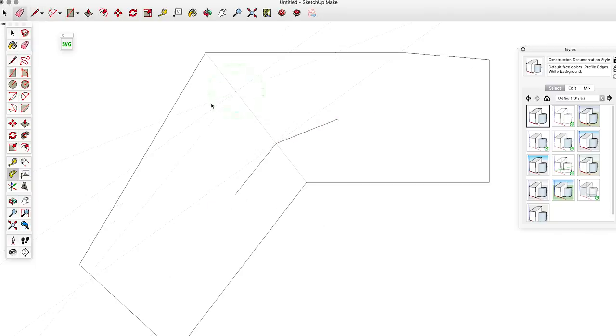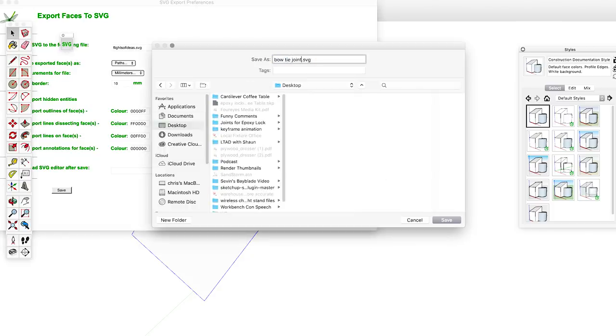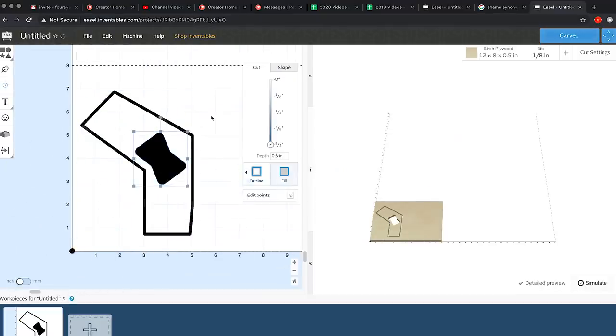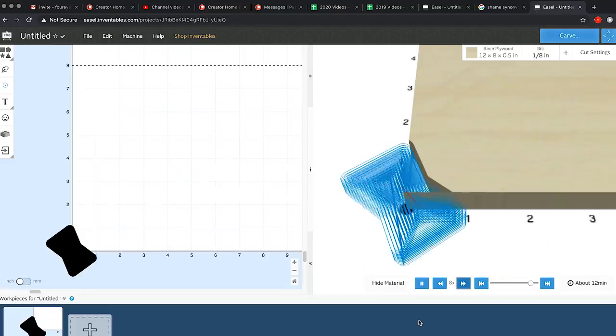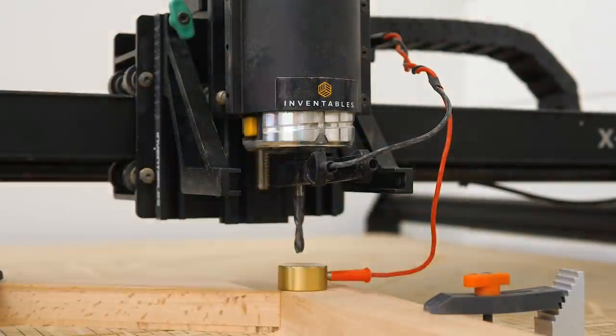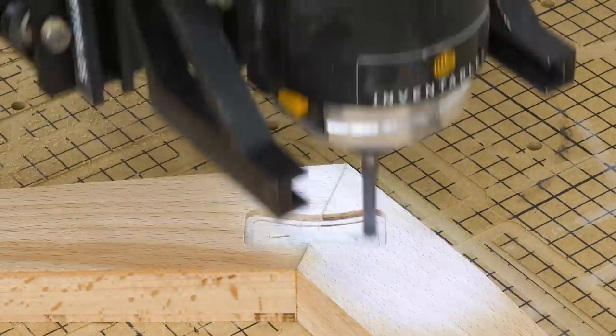You could cut this manually or with a CNC, but for my purposes I'm going to use my X-Carve. Here you've been seeing me model my first idea, which is basically like a butterfly or bowtie. Once I was happy with the shape, I exported it from SketchUp as an SVG file that I could import into Easel to cut on my X-Carve. In Easel I had to eyeball it so that the center of the cut was positioned right at the 0-0 origin within the software. Then in real life, over on the X-Carve, I positioned my bit at the center of the joint and hit carve and let it do its thing. For the most part this went really smoothly — I only had one mess-up on one joint, definitely user error where I kind of positioned things badly as a starting point.